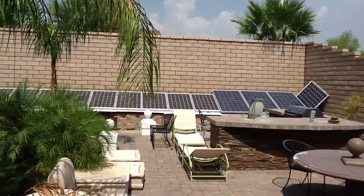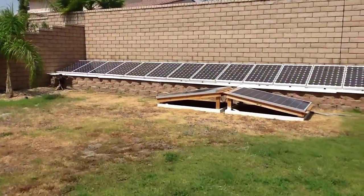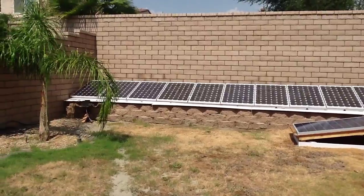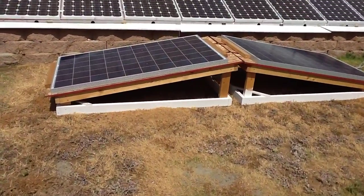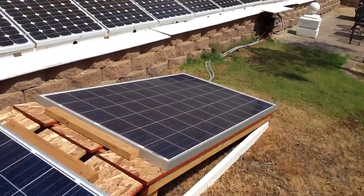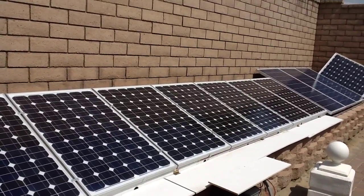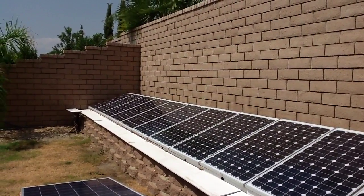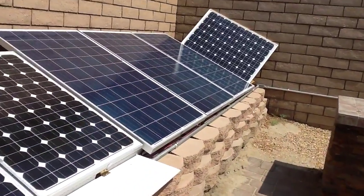Here's the go with the panels. As you can see, I've got quite a few of them here. These are 230 watt, 8 amp panels, 36 volts. These are tied in with the batteries. And then we've got these 120s — they're about 6.5 amps apiece and they are 17 volts each. And then we go back here and we've got more of those 230s.